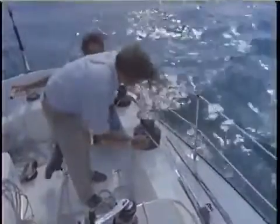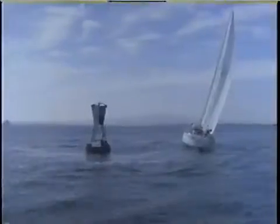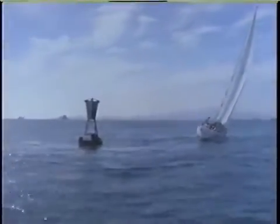Another person gathers the chute onto the foredeck and down the hatch, and when about half the chute is on deck, the guy and sheet are cast off so the rest can be brought aboard. Now that's a fast takedown, and it works for a jibe takedown with the pole dropped in advance, as well as for a conventional drop.